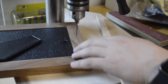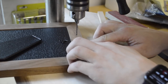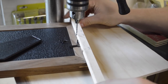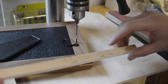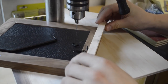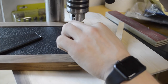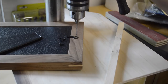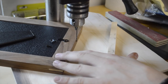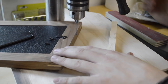I'm going to pre-drill some holes for the tiny screws that hold the hardware supporting the backing of the picture frame. To determine where the holes go, I made a sort of story stick. I line it up at the back — there's a marking for the short side of the frame and two markings for the long side. The width of the stick is set so that if I line up the bit with its edge, the hole will be in exactly the right place for the hardware. I also have the depth stop on my drill press set to just under the screw length, to make sure I don't go plowing through the whole frame and ruining the front.